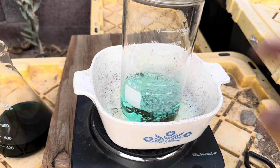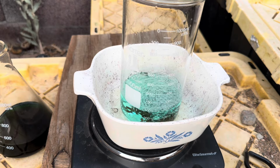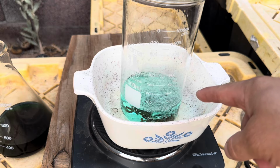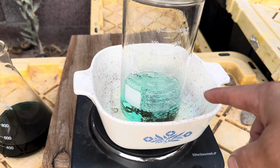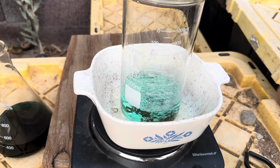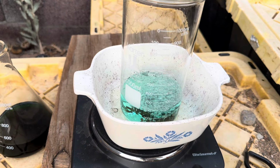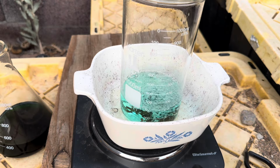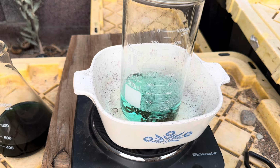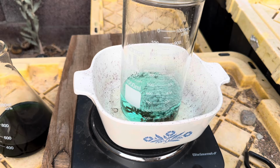So this is the third nitric boil, and we have very little color showing in there. So what I'm gonna do is save this dilute nitric acid, because there's still active nitric acid in there. I'm gonna save that for another refining I got coming up. I'm gonna get this washed and rinsed out and do at least one more boil. It might be two more till we don't see that color, and then we'll pull it off and may even get to dissolve that gold tonight.